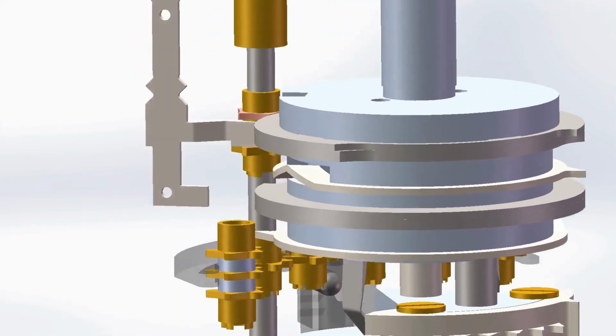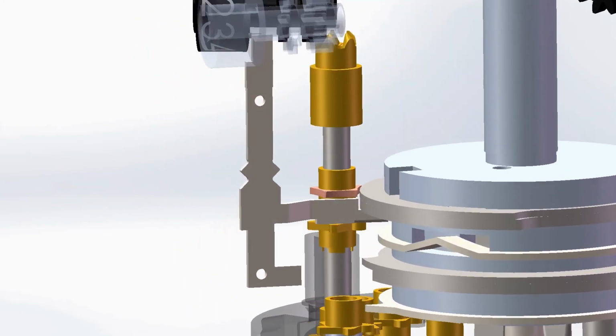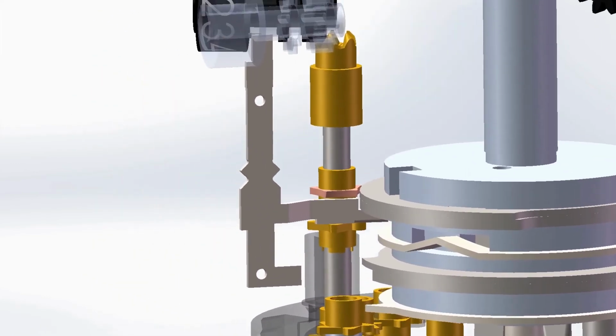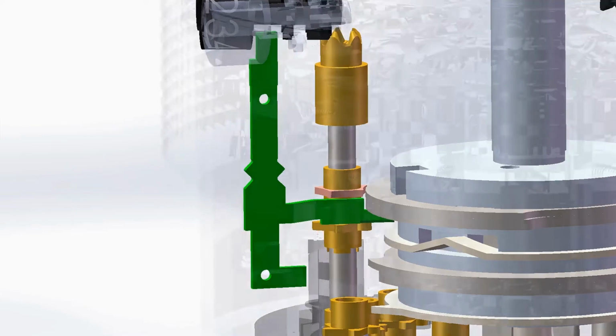Due to the elevation of the second set of locking rings above the results counter set, a separate turns counter carry increment disc is also required, as the count gears which handle carry operations, as before, are in the same assemblies as the lock gears. To accommodate this higher position, the turns counter carry levers are also modified, and their arms extend to the lock and count gear assemblies through a slot in the upper main casting.